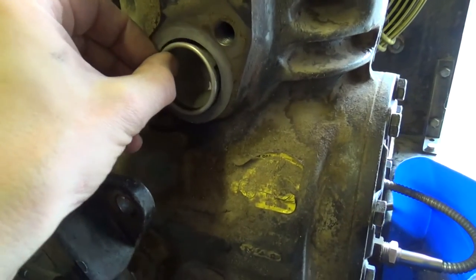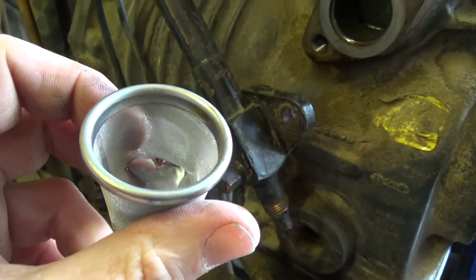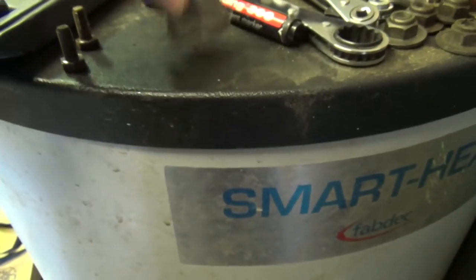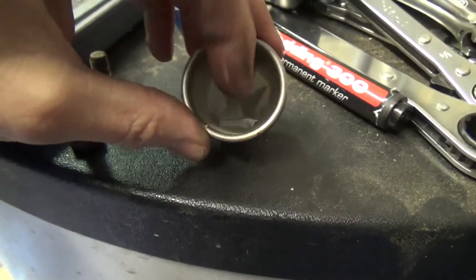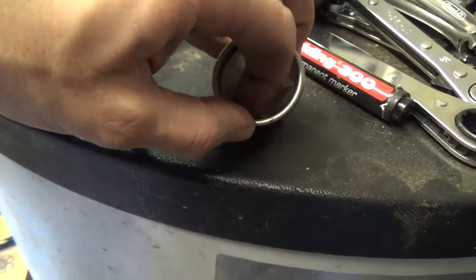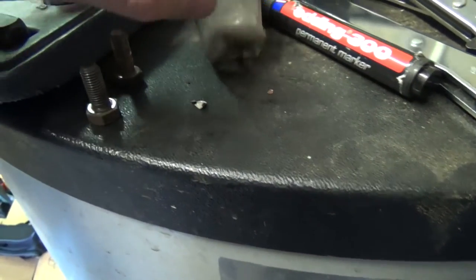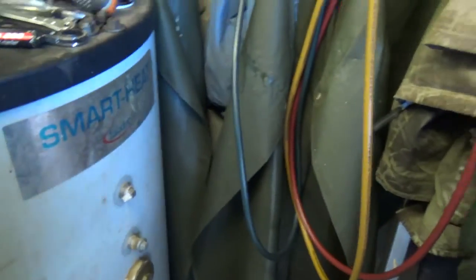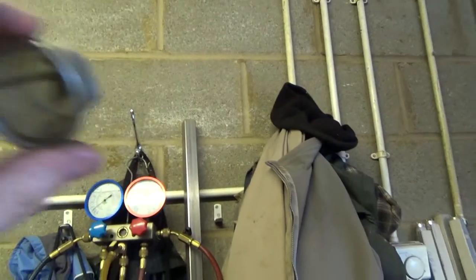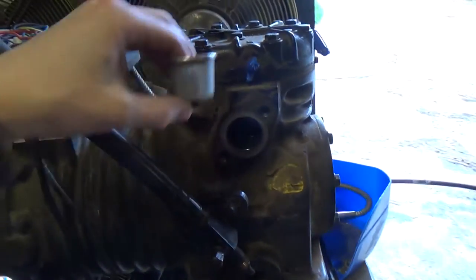I just thought I'd show you this - it's always interesting to see what's been caught in the suction strainer. Some little bits of copper. Got a piece of plastic from somewhere, a little bit of sticky tape that's got in the pipework. Found a piece of breeze block in one of these once - somebody drilled a hole through a block wall, fed the pipe through, and a lump of breeze block got inside. It took 20 years to wear through the mesh, and once it got into the compressor it smashed all the cylinders up.